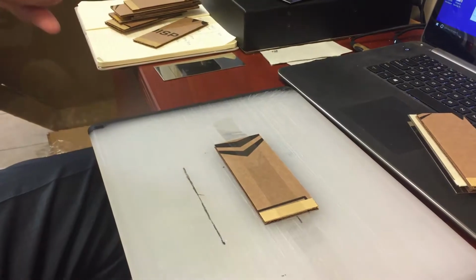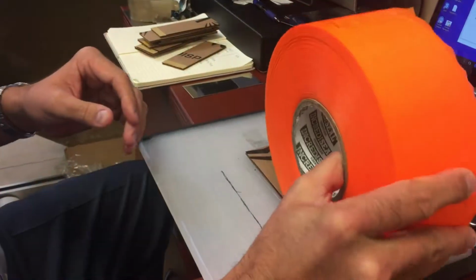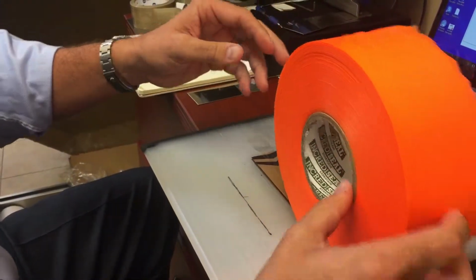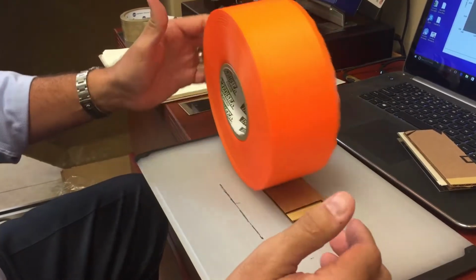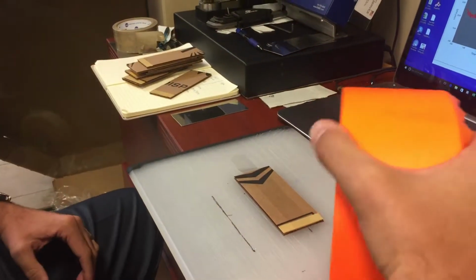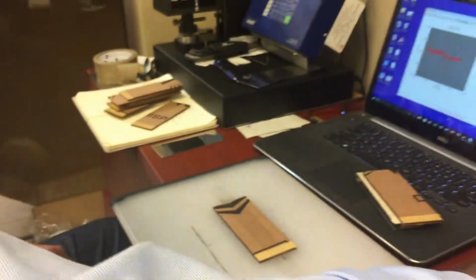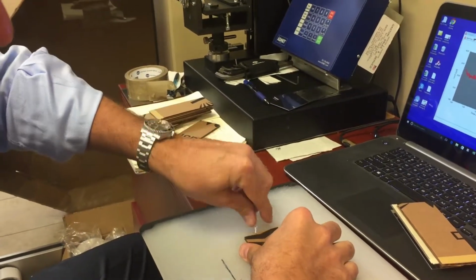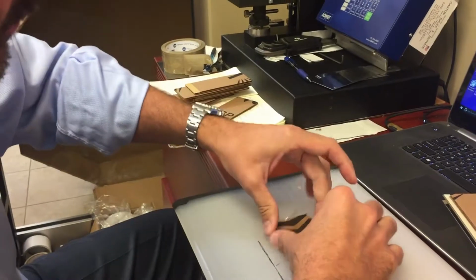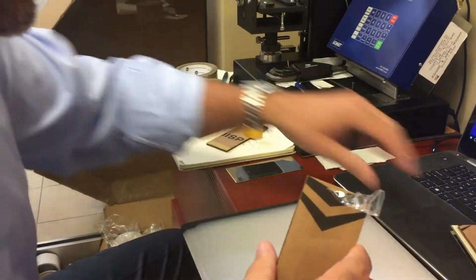We want to make a note, the second hand is 25 seconds on my watch because we only want to keep the adhesive on here for 1 minute. The next step is going to be to apply equal pressure to the tape applied to the piece of cardboard. So for that, we're using this as a standard weight. We're not putting any downward pressure on this when we apply it. I like putting a little tail at the end of the cardboard here. I'll show you why in a second.